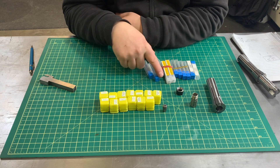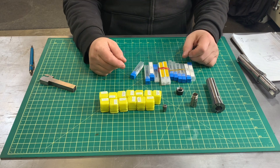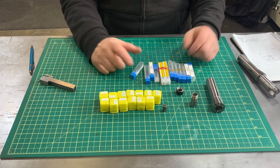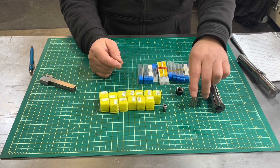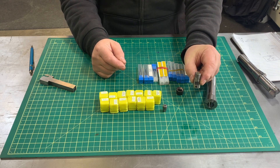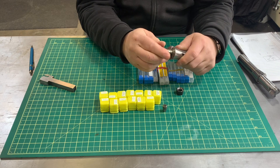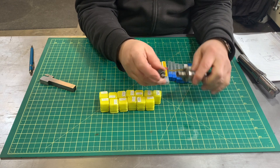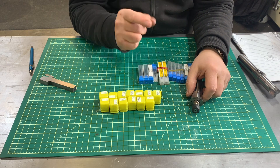For $37 I'm going to have a fully functional metric system to hold these little tiny bits in my milling machine. Don't fret — it is possible and you don't have to spend a fortune. Recap: this is an R8 five-eighths-of-an-inch collet, this is an ER11 chuck that fits because it's 16 millimeters — fits right in there. You'll be able to put whatever size collet you have in there, tighten it up, and you are good to go.